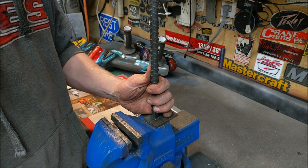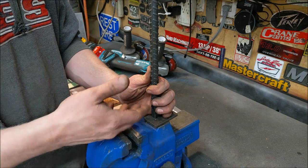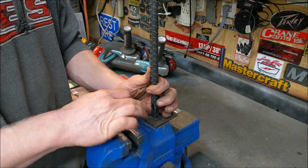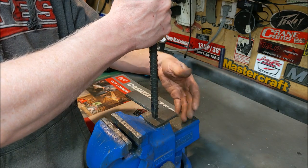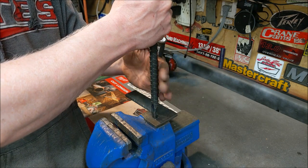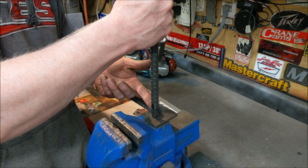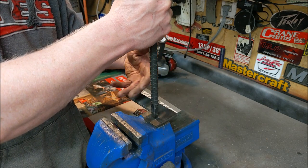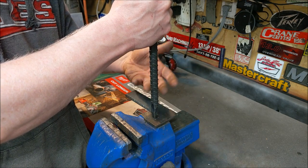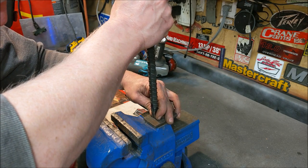Put your safety glasses on because we have hardened steel down here. If you get it too hard, sometimes it'll chip off a corner — it can fracture. That depends on the rebar; some is harder than others with different content. If it chips off, just resharpen it and heat it up — warm it till it's hot but not red hot — then let it cool. That will anneal it a little bit and it shouldn't chip off again.